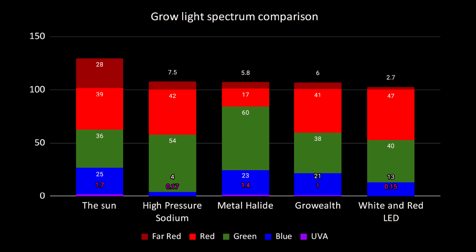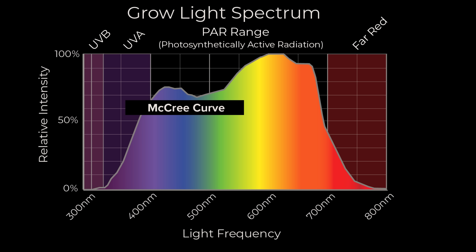But then you can see if you switch on the UVA LEDs, you get this peak on the left hand side, which is down at about 380 nanometers in the UVA range. And when you switch on the far red channel, you get an additional far red output on that spectrum. In percentage terms, comparing against other sources, you are getting an increase in UVA and far red in comparison certainly to white LEDs, and very similar in terms of output to what would typically have come from high pressure sodium and metal halide lamps.